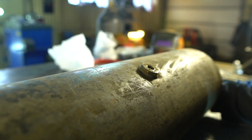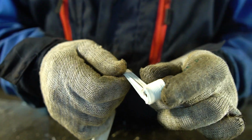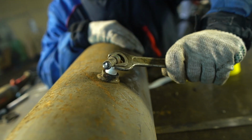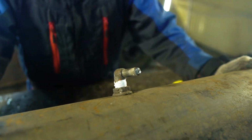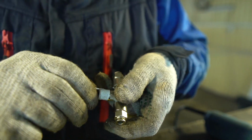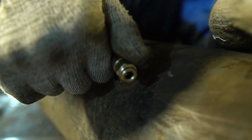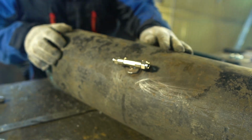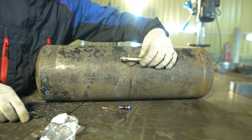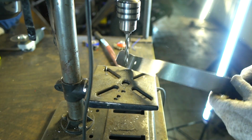We took the receiver from Kamaz, it's needed to accumulate the compressed air in the system. We'll plug one of the holes. It'll be possible to pour off condensate through it in future. In the second hole we'll screw in a T-joint with the hitches. We immediately made clamps to attach the receiver.